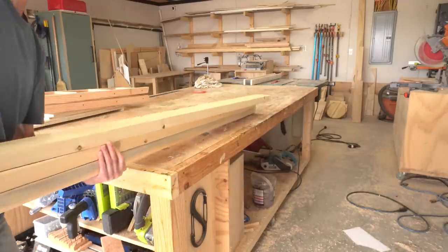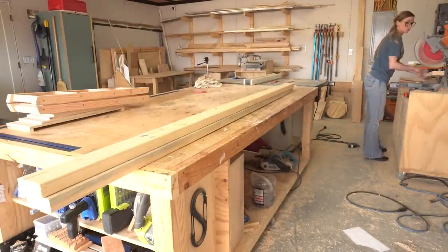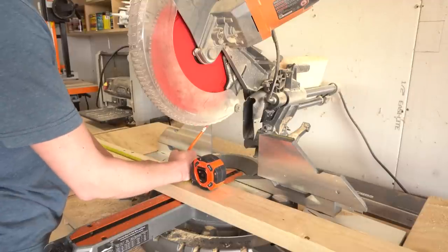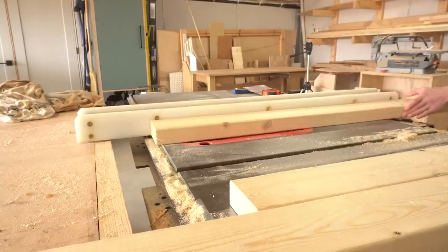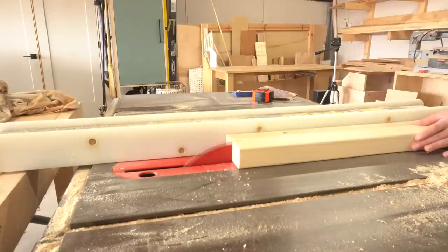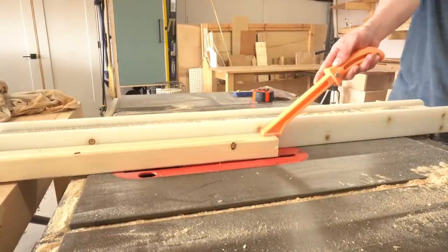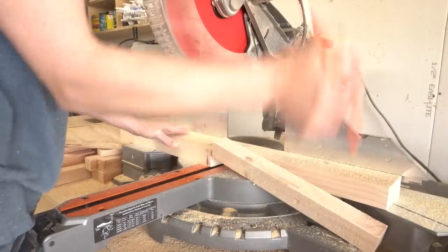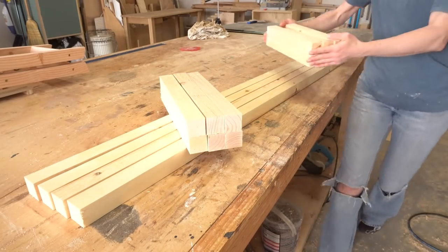I built this project from 2x4s and plywood, but most of the 2x4s were ripped into 2x2s to build the shelf frame. I trimmed two pieces of 2x4 to 5.5 feet long on the miter saw — these will be the corner posts — and the rest were trimmed down for the shelf rungs. I took them to the table saw to trim off one rounded edge, then adjusted the saw to cut inch-and-a-half pieces to make my 2x2s. You can buy 2x2s from the store, but making your own is much cheaper and they end up straighter and cleaner. Once the 2x2s were cut, I cut six rungs for each shelf frame on the miter saw, gave everything a good sanding, and proceeded to assemble.